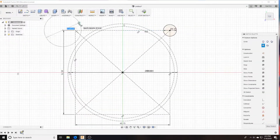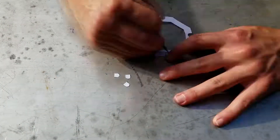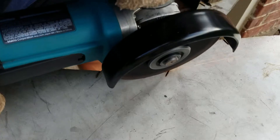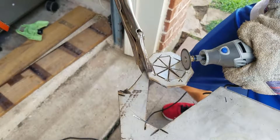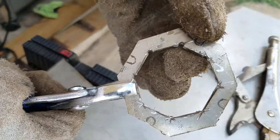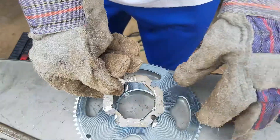In order to drive the back wheel, I needed to attach the right sized sprocket to match the chain and motor. I decided to model up a sprocket mount in Fusion 360 with the necessary bolt holes to accommodate the sprocket we had. Cutting the outer diameter was easy, but the size of the cutting wheel made it difficult to make it all the way through the inside, so I had to use a metal cutting wheel on a Dremel to complete the center. Once I made sure that the bolt holes aligned, I clamped it onto the back wheel sprocket and tack welded it.